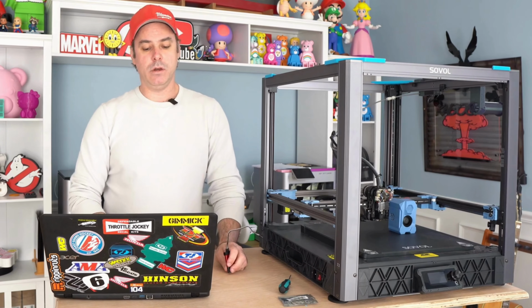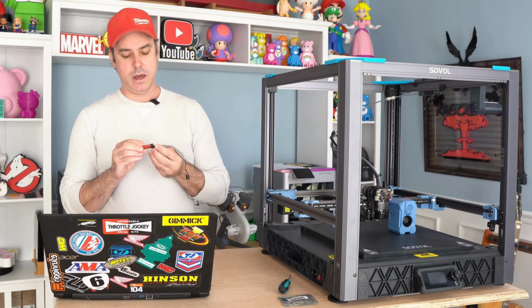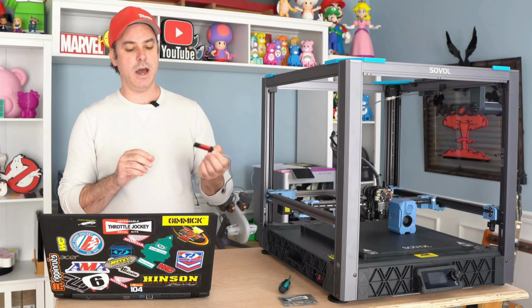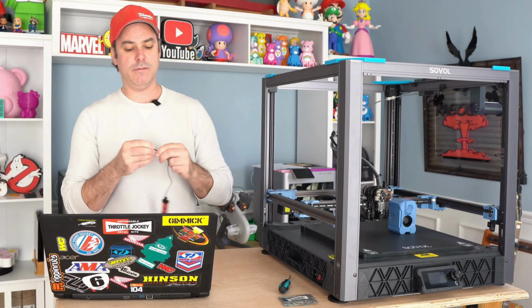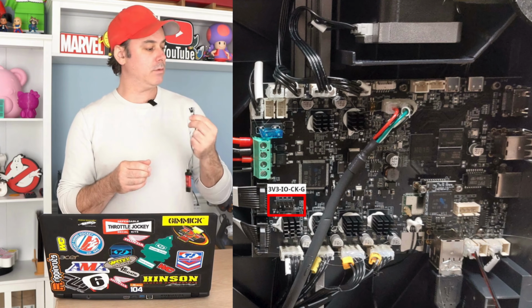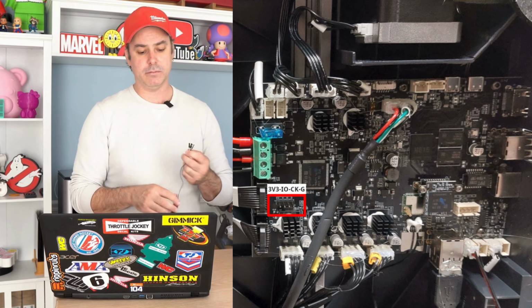So step 2, printer's off and everything. There are 4 pins that we're going to connect on our ST-Link. They are the 3.3 volt, there's an IO, CK, and then a ground pin. I have these labeled. I've taken from the instructions an on-screen example here of how to plug these in. So you can start with either the main board or the tool head to do these.